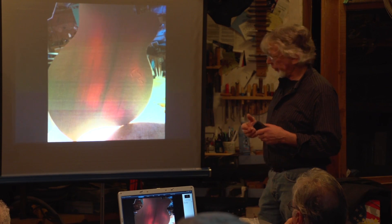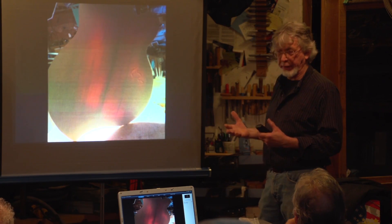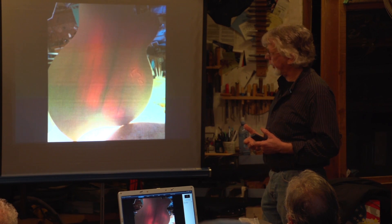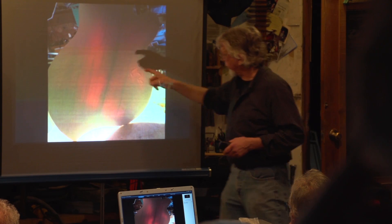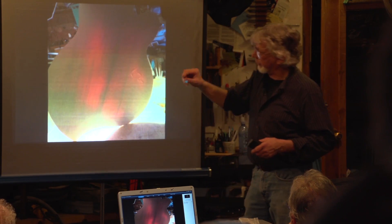I don't use this to tell me that it's 80 thousandths here — I use it to indicate an overall trend, because wood is, of course, driving all of us crazy for our whole lives. You never know what it's going to really do, but it is a pretty good indicator of just how thin these guys are. You would think this is paper thin, but it's really about 175 or 180 thousandths here, and maybe 150 thousandths here. That's pretty substantial.